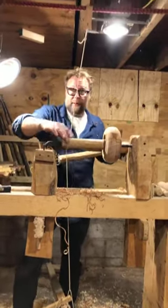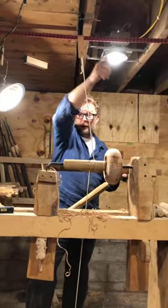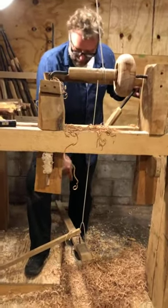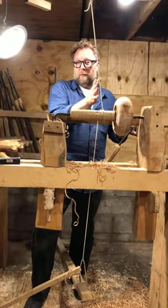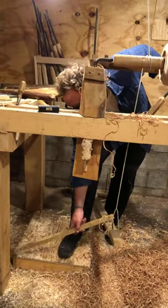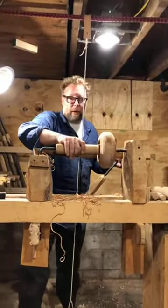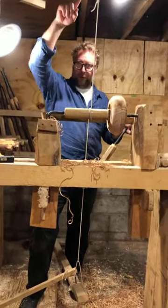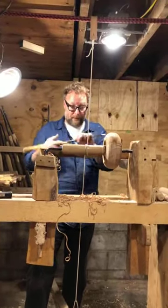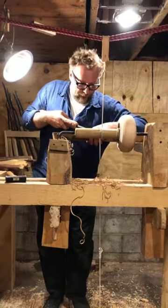With the setup now using this bungee, I can change the location — and then a step mandrel probably would work, especially with the movable pedal. I can move the pedal and my sway bar has holes so I can move this in different spots too. It would work, but you'd have to have a really versatile adjustable treadle sway pole setup to make it work properly. Otherwise it would just be more trouble than it's worth. There's no real need to change the diameter that much.